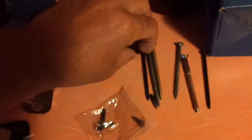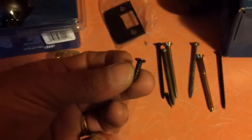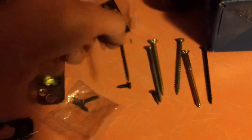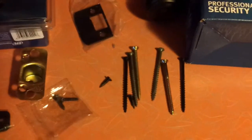And the hinges of the door — these are the exact same screws, and most hinges have four screws. You can take out two screws on each hinge; you don't have to take out all four because you'll mess up the door adjustment. I'll show you what I'm talking about as far as that.